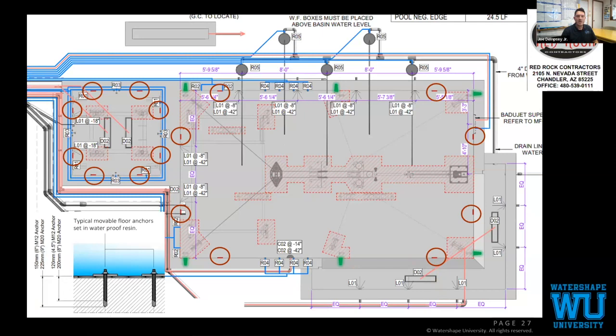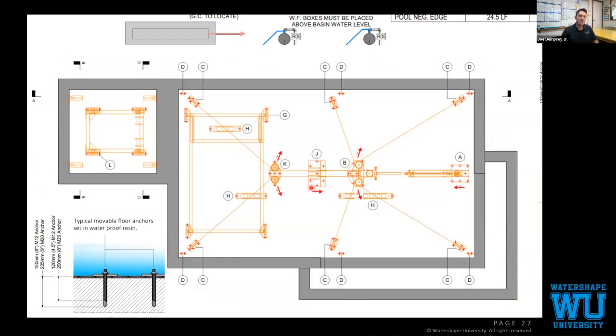We have our no drill zones. The rigs are clearly laid out on here. These are the drill zones, so no plumbing underneath them. They're going to drill 9 inches deep. They ask for nothing to go at least within 12 inches. The Twinscape plan shows exactly where each of those anchors is going to be placed.